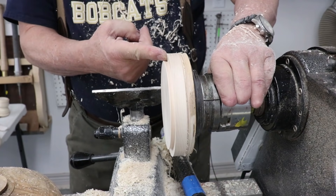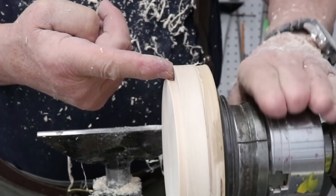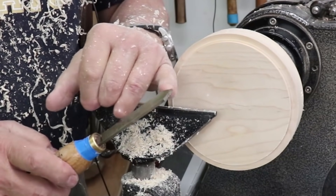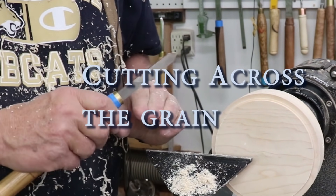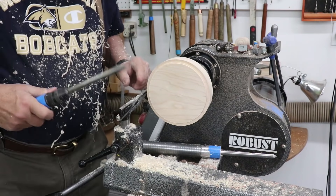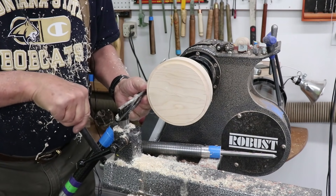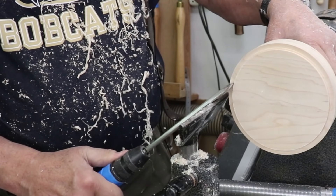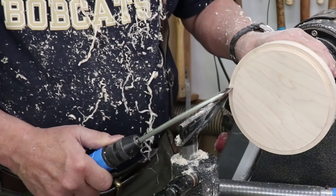There's my tenon. Here's a small parting tool — with this tool I've got the nose angled so I can get in there and form a pretty good tenon. Here's an important point since this is cross grain work: if I approach this piece with a cutting tool, I'm going to be in trouble when I get around to the end grain — I'll get a catch and a dig in and it's not going to be pretty. I could use this as a scraping tool totally horizontal, though it's really just scraping.